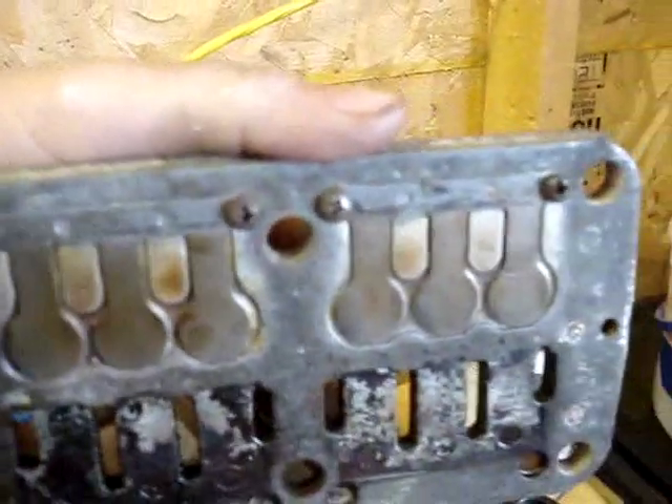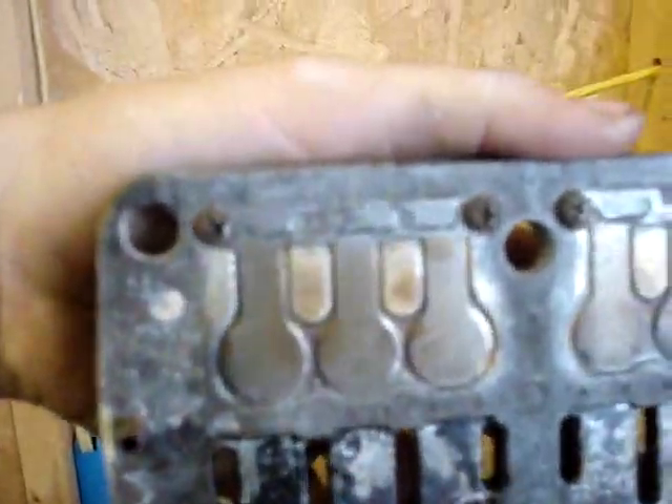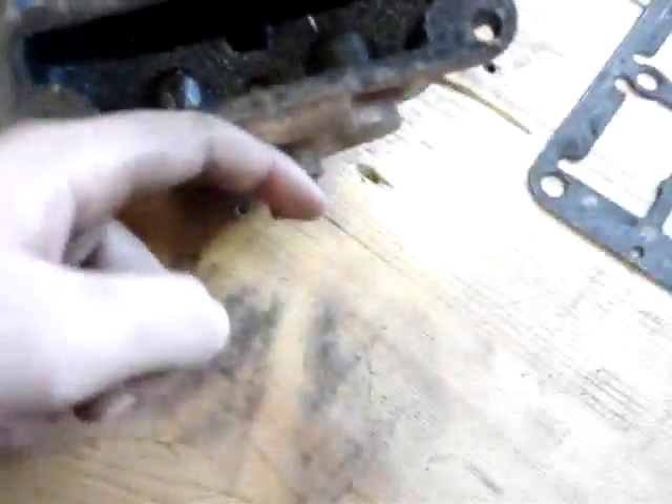It sucks it through these valves right here. They're just little flapper valves — they're actually called reed valves. Sucks it in, sucks it down through there. This is a two-cylinder. Then it comes back up and goes through these holes on the other side, and gets shoved back out through these valves on the other side of this plate. Shoves them out, comes up here, goes through here, comes out here.